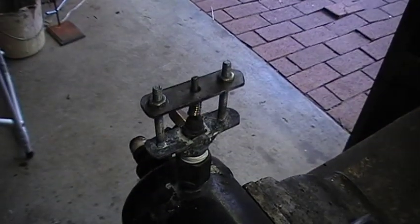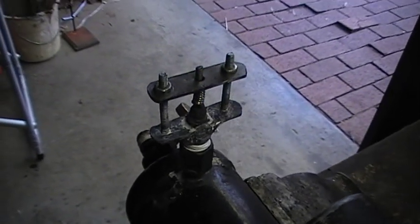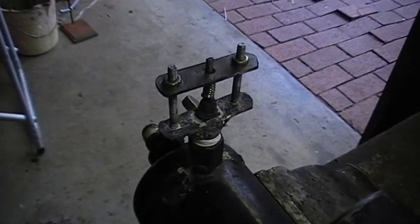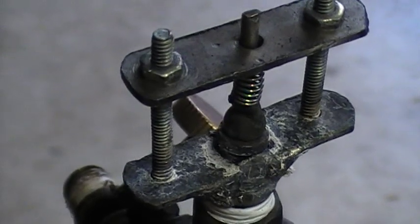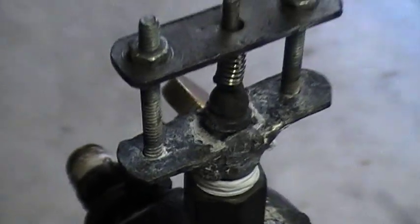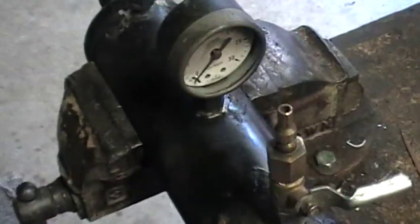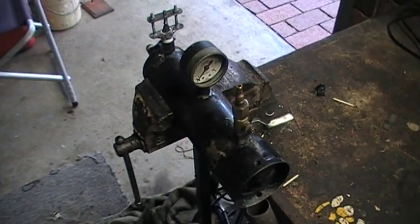I've made a safety valve. Don't worry, it won't blow up — I followed it from an 1870 patent and it's entirely safe. It's not like a blow-off valve; it always resets. It's got some tin can for the bits, a spring from a carburetor, and a small ball bearing. I've set it to go off at 25 psi, and this isn't going to get anywhere near blowing up because I've pressure tested this boiler to well over 120 psi and it doesn't even leak.